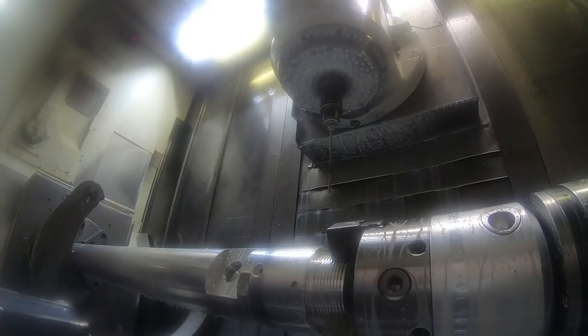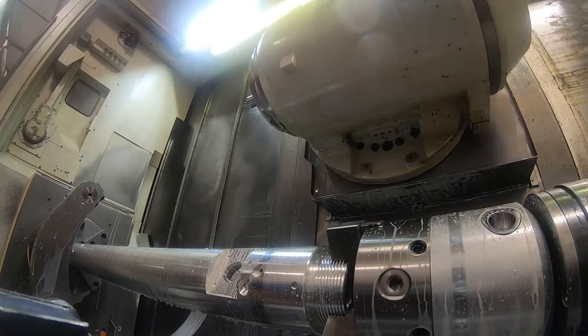And now we're going to drill those gun drills to intersect the sides of the tap drill for the 5/16. See, that one's going all the way through, and that seems to be all right if you can drill all the way through, but you wouldn't want to drill the larger drill to intersect that if you could help it. And this one's just going to go into the side of the cavity you can see there, or the tap drill hole. And that's what I was trying to show with those little inserts.